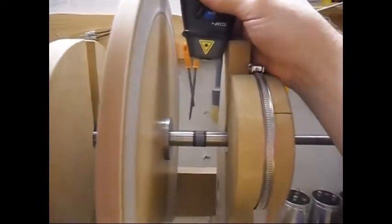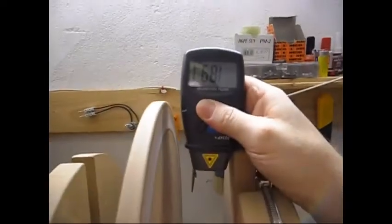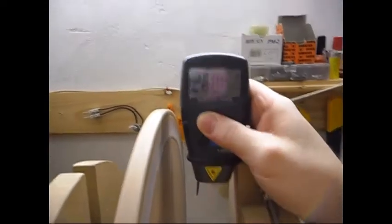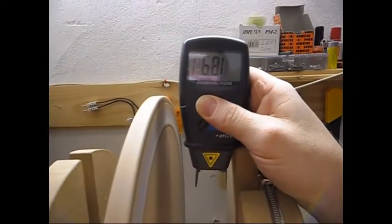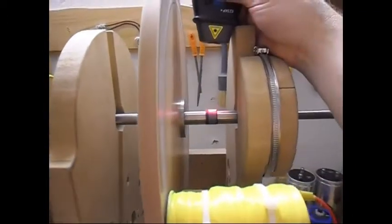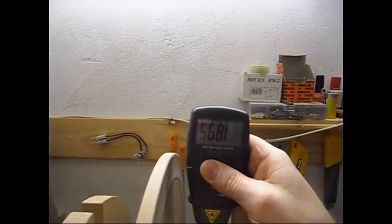Now I'm gonna short the coil over here. It is shorted DC, shorted milliamp 190, but we cannot use that at all. But I'm doing it anyway. The RPM is now at 1891, 92. So it is slightly increasing, 1890 something. Okay, 95. Let's say 1895. So shorting this coil does not put maximum load on the system. Until now it has been the 0.6 watt load.